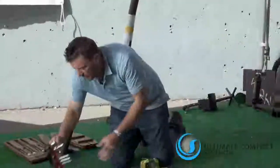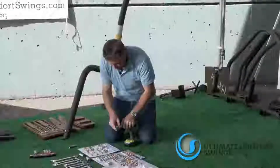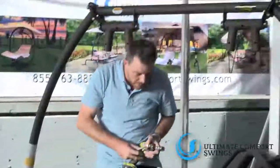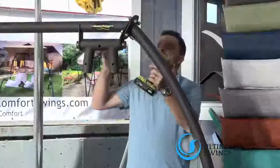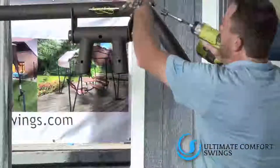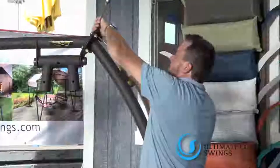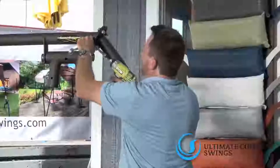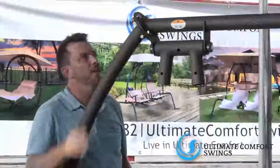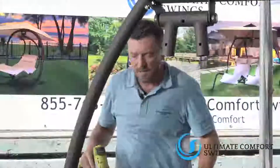Put the 16 back. Now we need a 19 with the extension and an 18. You can do 18-19 or 19-18 for the bolts - there's one 18 and one 19, doesn't really matter which way you do it. Use the open-end wrench and always go opposite directions on these, kind of crisscross like you would a tire. For the last set, maneuver the leg to where it's almost already a circle - that way it's all set and level, and there's no chance of the legs moving on you.